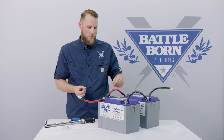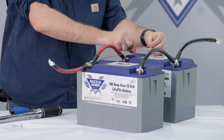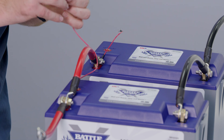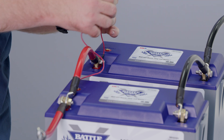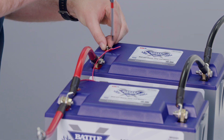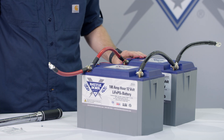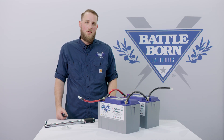Starting here, we'll keep the original screw and install it onto the enable post. Next, taking our M5, or our 5-millimeter long screw, we'll run our jumper to the next battery, remove the screw that came with it, place it through your daisy chain, and then through your main jumper, and install onto the enable post. Do not over-tighten, but tighten it firmly enough to engage the lock washer capabilities. With this setup, both of the internal heating functions of the batteries are now enabled.